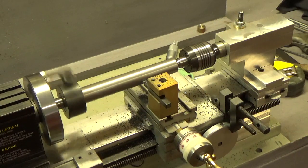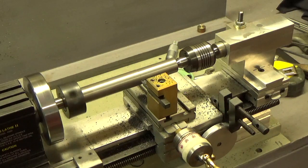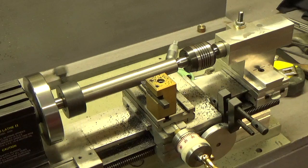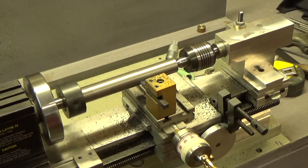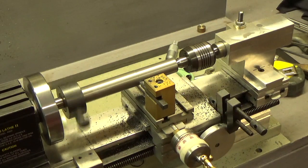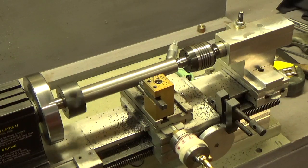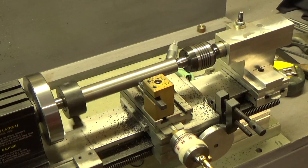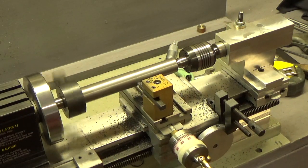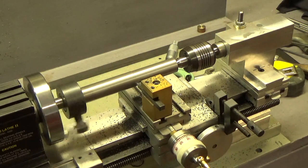I think that's about all I was planning on telling you. The MT1 Morse taper in the quill came out absolutely perfect. I got a through hole in the quill now, so I can get the center out of there, but it's in there tight. Believe me, it fits perfectly. So those cutters that I purchased very cheaply, they worked absolutely fantastic.